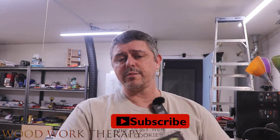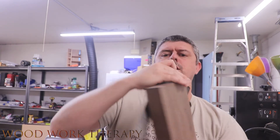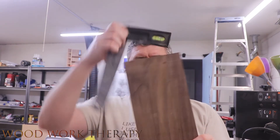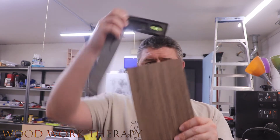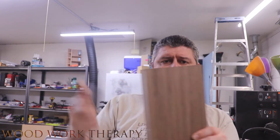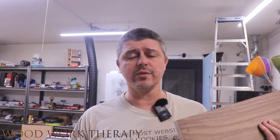Let's check and make sure that we're all square — looking good on both sides. I'd say we achieved our goal; it's actually really, really good. Sometimes things look square when you cut them and they're not. It's a little overkill on a shelf to be this perfectly square, but why not put some perfection in your work? Keep in mind, you could have simply sanded this or used a hand planer — you don't necessarily have to go to this extent. But if you've got the tools, use them; if you don't, there's always an alternative.